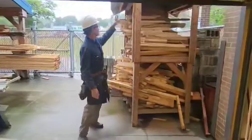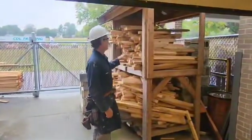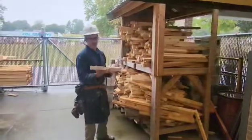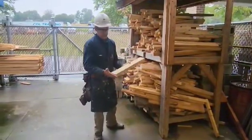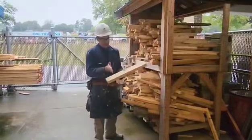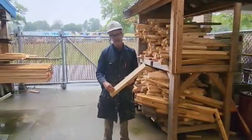So in our shop here, we have a scrap rack where a lot of our fall-off comes from the projects we've built. We're going to pick and choose a two by four out of our rack here. We're going to look it over real clear, make sure we have no nails in it. We're going to make our grade stake 20 inches long, so we can pick from multiple pieces here. But we need to make sure we have something that's going to be 20 inches long with no nails in it anywhere.